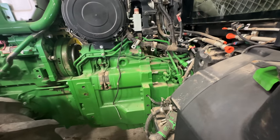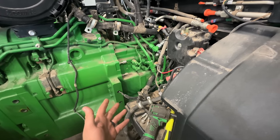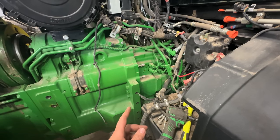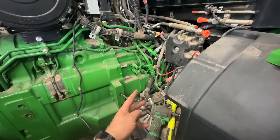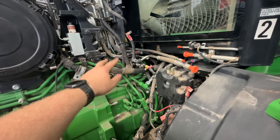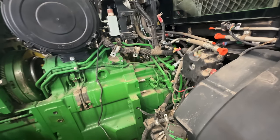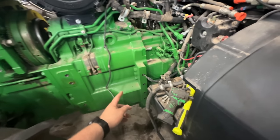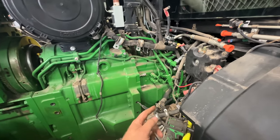All right, so before we make a mess right here with these steering lines, my thought process is, if you're going to start disconnecting hydraulic lines and making a mess, you want to start from the bottom and work your way up. So instead of wallowing in the oil we make from taking those steering lines off, we need to get underneath and start disconnecting the lines and the drive shafts off the back of the transmission, and work our way up to the steering lines, the heater lines, and the hydraulic cooler lines going in the transmission, so we ain't having to wallow in the oil and having it drip down in our face. I want to get all that done before we put the splitting stands under the tractor. We'll have everything disconnected except the mounting bolts here and here before we get the splitting stands underneath it. So now is a good time to go underneath and work from the bottom all the way up.